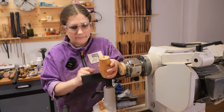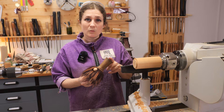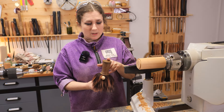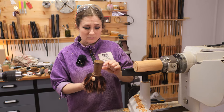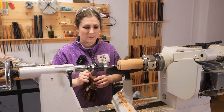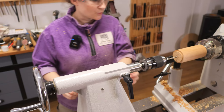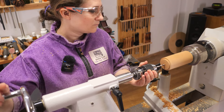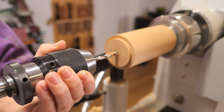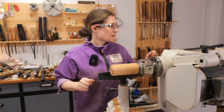That peg is about 5mm in diameter. If you do a smaller gonk you can make a smaller dowel — whatever works for you. So for this one it's about 5mm, which means we have to drill a 5mm hole for that to fit into on the hat. We're going to start with the easiest hat to make. The first thing we need to do is drill a hole in the bottom of the hat so it will sit onto that little dowel. We've got the Jacob's chuck in the tailstock with our 5mm drill bit, and we're going to drill about 3–4cm into that piece of timber. Turn your speed right down to about 600 rpm — nice and slow for drilling.